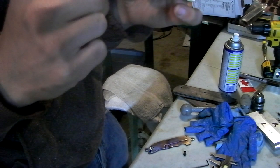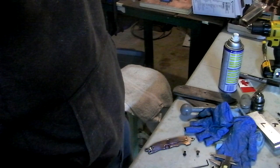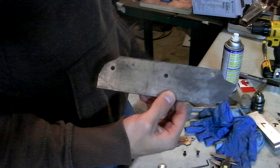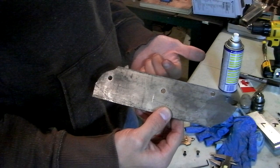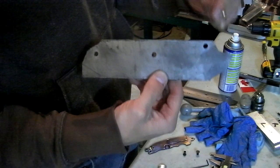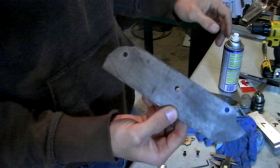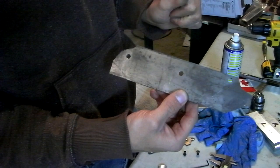So yeah, it's already 2 a.m. Depending on how late I want to stay up tonight, I think I'm going to make the right-hand side handle of this, and then probably hit the hay. Yesterday I was able to rough out some blades. In the future, and for the class, I'm going to get these water jet, but for these tests I'm just using square rectangular pieces of steel. So I had to cut out the clearance holes, the locating holes, and just some clearance issues, which is not an issue anymore now that my fixture is totally flat. Anyway, now the blades, at least the blanks, are ready to go onto the fixture. I still have to write a lot of code to figure out how to profile and cut and machine this whole thing, but...